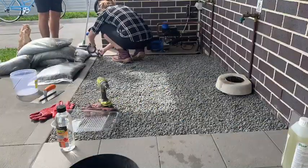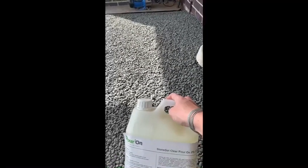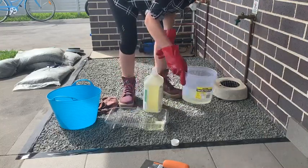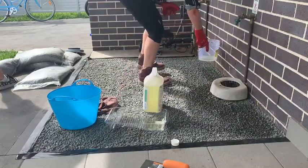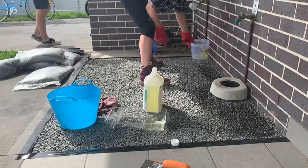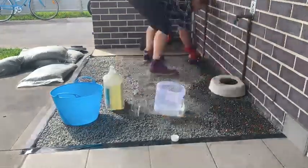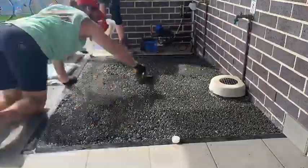This is a relatively low-trafficked area, so I'm working on the basis of one and a half to a maximum of two litres of binder per square meter. The key is to do a light coat — rather than applying all the product in one go, I'm going to apply half the container for three square meters, let it cure, then apply the other half as a second coat. It's really important to do two light coats rather than one heavy one because it reduces the chances of foaming. It's looking good — a little bit of resin on the masking tape, but that's what it's for.